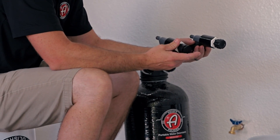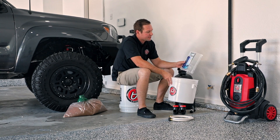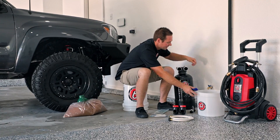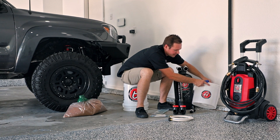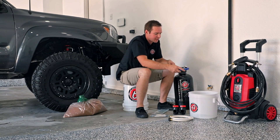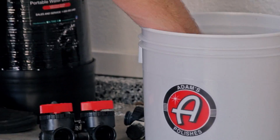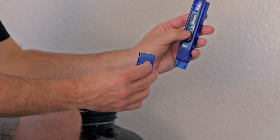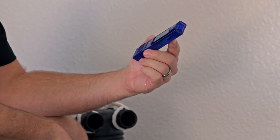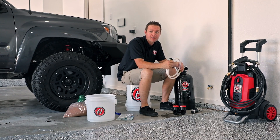You'll also have a male and female upstream and downstream spout, and a TDS meter. We're going to test the TDS — or parts per million — of a household water supply. Get a sample of about half a gallon of water in the blue cap, turn your TDS meter on, and stick it in the cap. This water supply reads 150 parts per million.